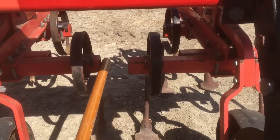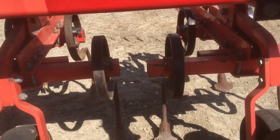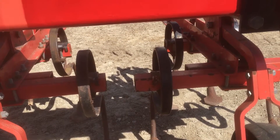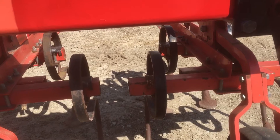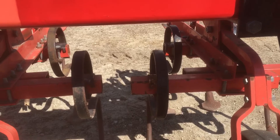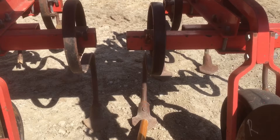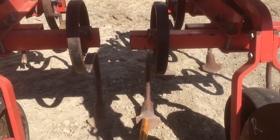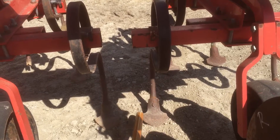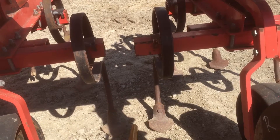On my other cultivator, I showed you that gap being 12 to 14 inches, and that's what I like to run. That allows you speed when the crop is relatively young — having that wide gap and rolling the dirt in. Now what we're going to do with this cultivator is put those little spikes right next to the row, and instead of a 14-inch gap, we are going to pull that gap down and experiment to find the right gap to just barely bubble dirt up right on the row.